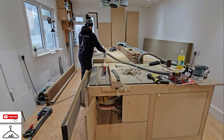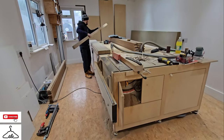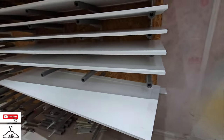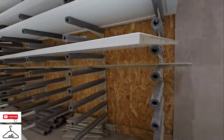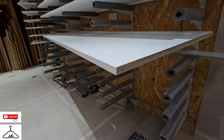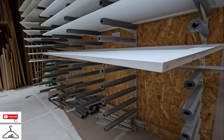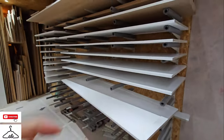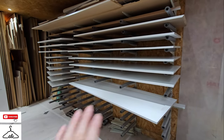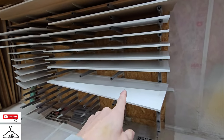So that's the materials talked about. The construction process is a piece of 12mm with 6mm strips on the top. If I go into the spray room, I'll show you one in the painting process. We've been painting a few up — we've got a job on where we've got 12 doors. This has been primed both front and back, and we're going through the process of giving each door 3 coats per face. You can see the methods — you've got the 6mm at the top and the 12mm at the bottom, and they stay nice and flat. Please go and see one of my videos — I'll leave a description up top — about how I stack all my materials and get those edges up to a really high-end finish without a lot of work, without doing them singularly. You do them as a pack.